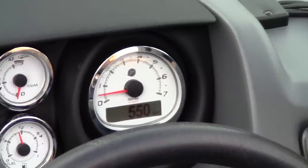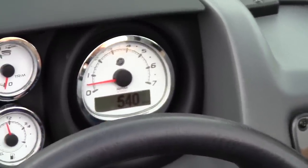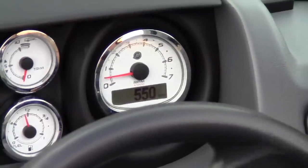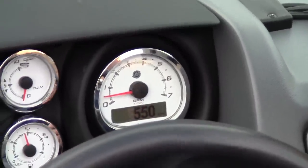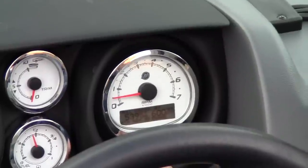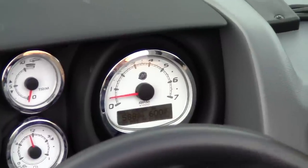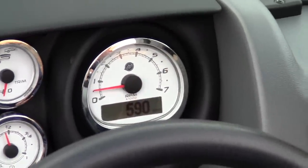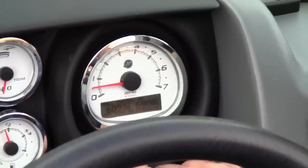One other really nice feature: if you're an angler and you do some occasional trolling and you have a four-stroke Mercury motor, you can adapt this to most of the bigger Mercury motors, anything from 75 horsepower up. I can actually turn my main motor into a trolling motor by just hitting the troll button. I hit the mode button to engage it and it takes me to what engine RPMs I want to operate at. This gauge allows me to adjust engine RPMs in 10 RPM increments, from 550 RPMs to 1000 RPMs.